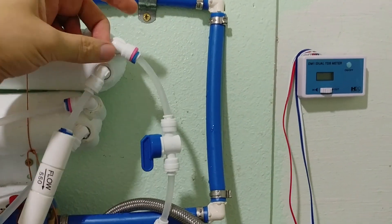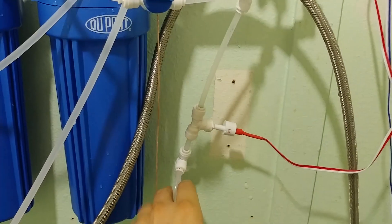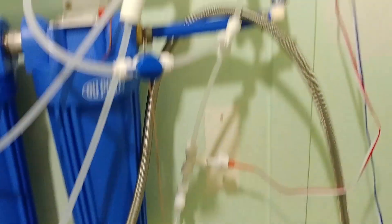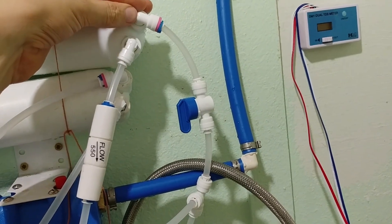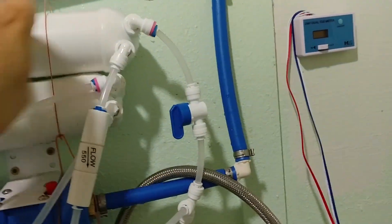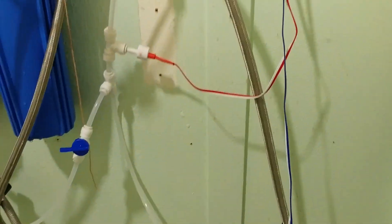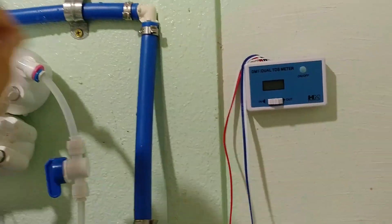I've got it running straight into the drain because sometimes I just need chlorine-free tap water. You might notice the connector on one output is pink — that's because it's a one-way valve. When I've got these two RO outputs mixing together and then tap water coming in from the pressure regulator, these one-way valves guarantee that if there's ever a water pressure issue, it won't force water back through the system and damage my membranes. I've also got a couple of sensors — one before the tap water mix and one after.